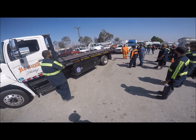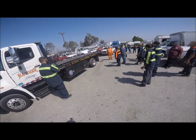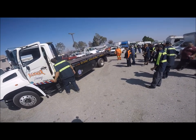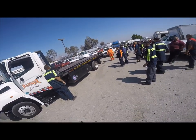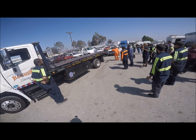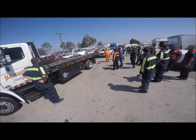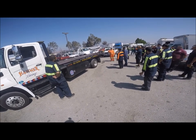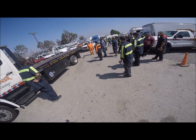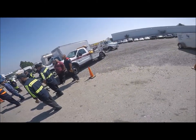So how much capacity do we have? 8,000 pounds. That means if we put 8,000 fully distributed on both front and rear axles, we could put about an 8,000 pound vehicle on here. For the rear axle — if the truck weighs 17,500 and we have 10,500 on the rear, we've got about 7,000 pounds of capacity there. So if we put more than 7,000 up here we're going to overload the rear axle.